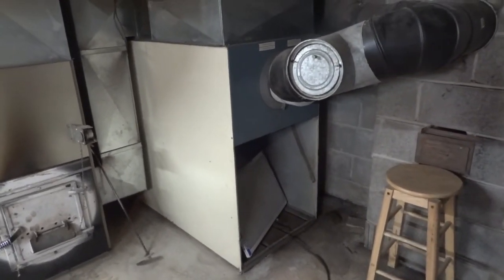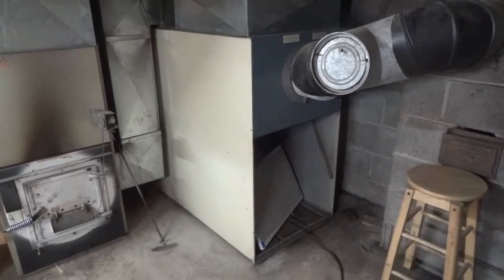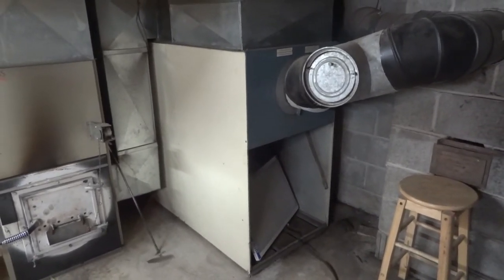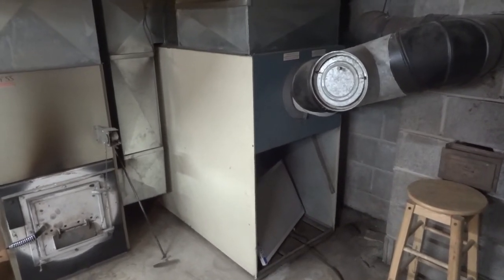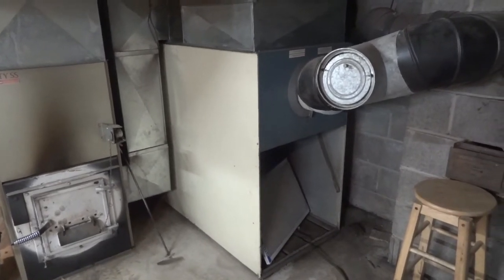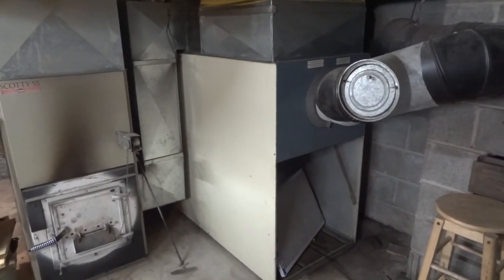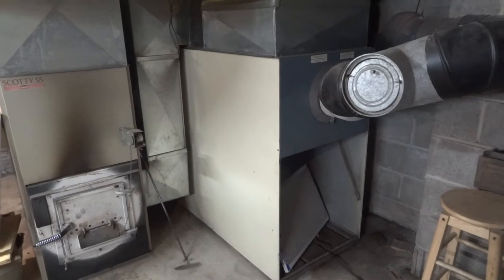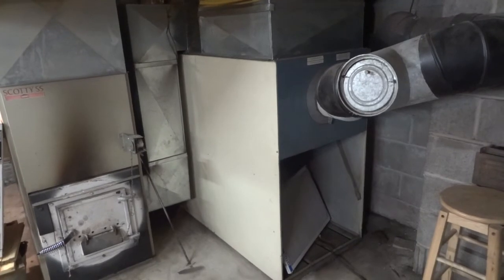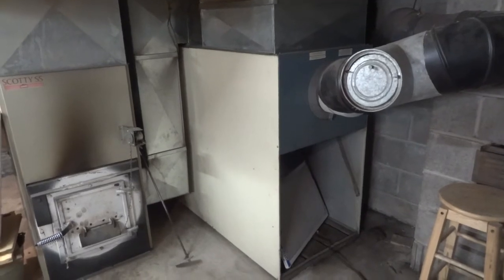So he used to take fan centers. He'd rip the whole controls out of the furnace, and he had his own plans and specs and drawings and stuff, and he put in a fan center, and he put one of those temperature probes hooked to the fan center, and the furnace would run on low speed. And of course, there were electronic air cleaners back then. There still are. There's better ones, I imagine, now. So on low, it was filtering in your house all the time, and just a little bit more in electricity a month. Back then it was $5-$10 a month. Then when the furnace comes on and it calls for high heat, it clicks out of the low speed and goes to the speed tap that you've chosen for the house, which is much more efficient.